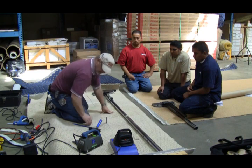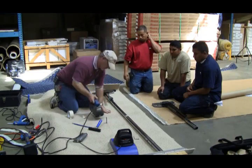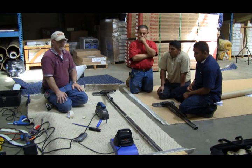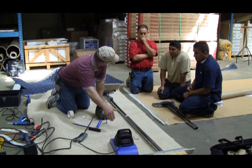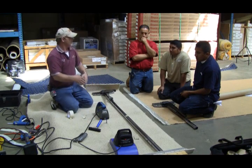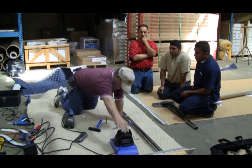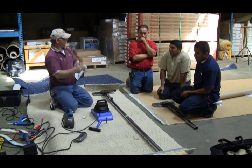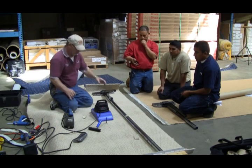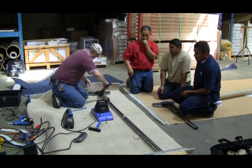Now I'm going to come up here in this spot. And what I'm going to do, I'm going to stay nail it. I'm stay nailing it with this, just like spot welding. It's not on back here, right? All right. So now I'm stay nailing. It went off. All right. Now normally when you run your iron and you're starting in the middle, you got to wait for it to cool. How long? 3, 4, 5 minutes? Not now. I'm going to come up here within 20 seconds. I'm going to suck that up. It's cool. I can stretch again. It won't move that spot. All right? So I'm going to cool it. Matter of fact, it's already sucking good enough that I can go ahead and get the pattern to come up here.